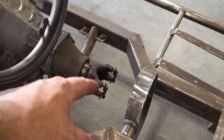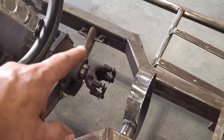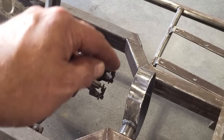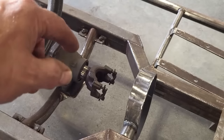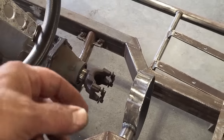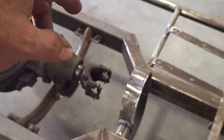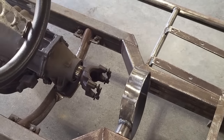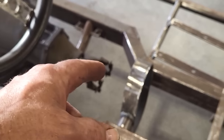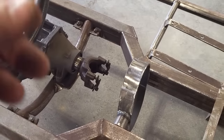To me, it's more of a safety thing for the yoke as well, but it gives you a solid base to put your shifter on, and you haven't got to worry about it. You just have to drill and tap it, okay? Once it's tapped, you just put two bolts down to the floor. None of this sheet metal screws and nuts and bolts and all that type of stuff. You don't have to worry about any of that. Just find a spot, put it down there, and it's solid in the car. You can basically put the shifter into this car now with no floors in it and get everything operational, and you wouldn't have to worry about it.